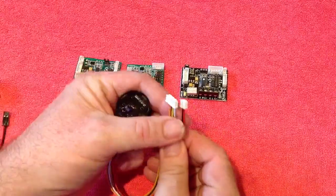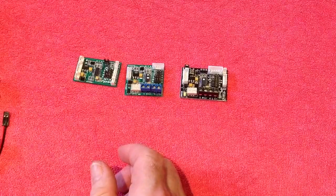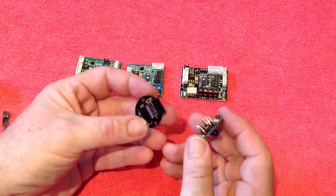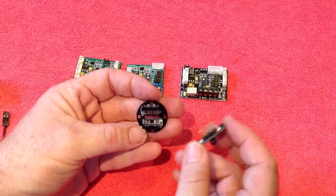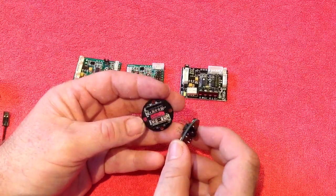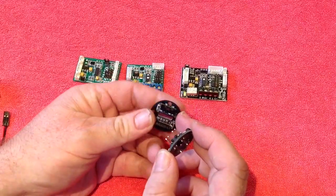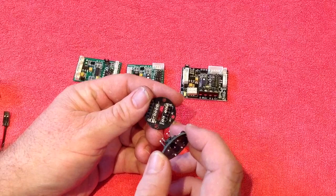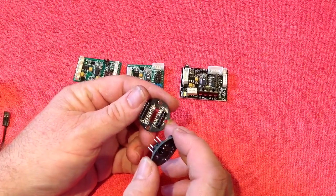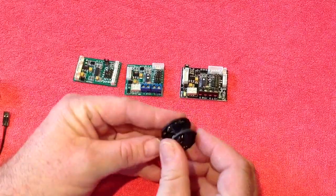So it's important to let me know what type of connectors you need on your Hammerhead 2. The Hammerhead 2 unit itself comes in two parts: you have a base unit and a top unit. It's important when you put them together that the IR LED is towards the IR LED side. This does say IR plus and IR minus, so this side is the IR side, so it plugs in like so.